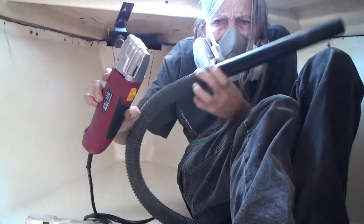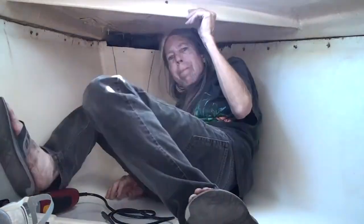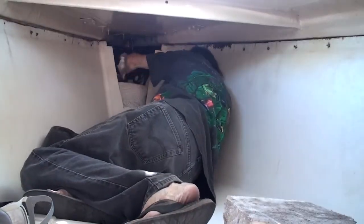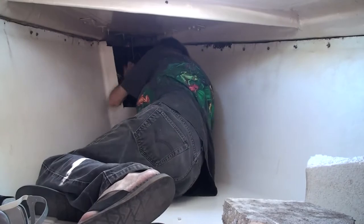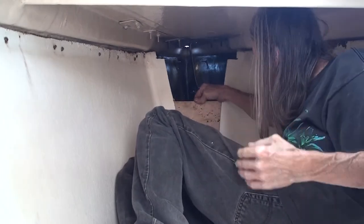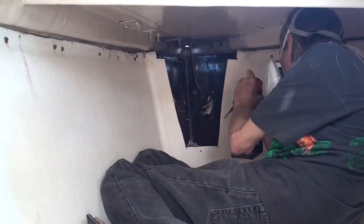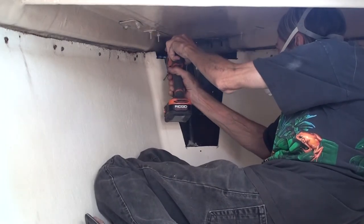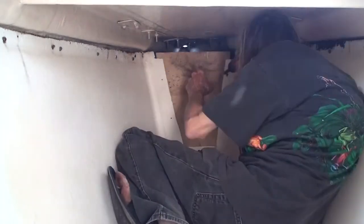I'm cutting through the forward bulkhead because I need to get access to the front of the boat to work with the running lights and do some different things at the front. I'm removing some flotation foam and hopefully will replace it with an equal or greater volume of foam elsewhere. I've cut these plywood pieces to cover the hole, and I'm drilling holes so the plywood goes on the other side of the bulkhead — the anchor rode pushes it against the bulkhead instead of having it fall into the cabin while I'm sleeping.